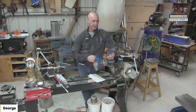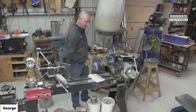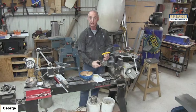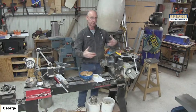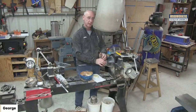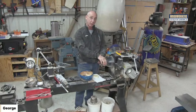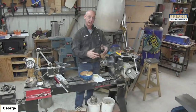Joanne asks: what's the minimum size tenon to use? That'll be controlled by your chuck. On this one, when the jaws are dialed all the way in I think it's two inches as small as they go, and around three inches as large. If you want to do bigger or smaller, many companies — this is an Easy Wood chuck — including Easy Wood make other size jaws. You buy one chuck body, and it's compatible with many different styles of jaws; just change the jaw out for something bigger or smaller.